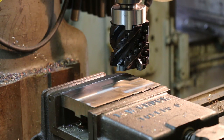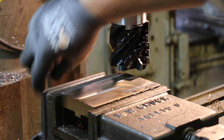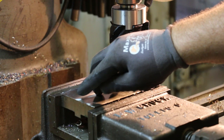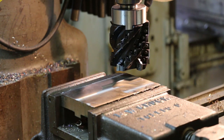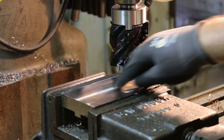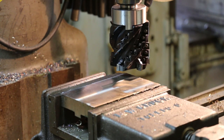Well, guys, we've had a little bit of a bozo moment here. So I knew the thickness that we needed to be right here, and I've been measuring that thickness. But what I should have been doing was measuring the thickness to the height of the T-slot that I want to mill in here. Fortunately, I caught it before I milled away all the material, but unfortunately, I'm only about 25 thousandths out. So instead of having a key or a T-slot that sticks up an eighth of an inch, it's going to stick up about 25 thousandths of an inch. Should be good enough to register it on the footstock on the piece that I'm making it for. I'm actually going to bolt it in place, so at the end of the day, it's not that big of a deal, but it is a big deal because it's not what I was shooting for. I'm a little upset with myself for making a bonehead mistake, but oh well, live and move on.